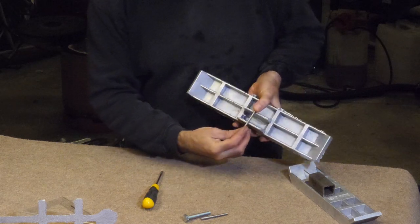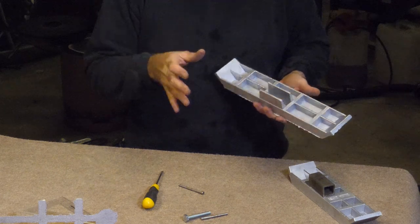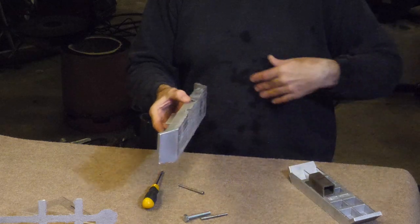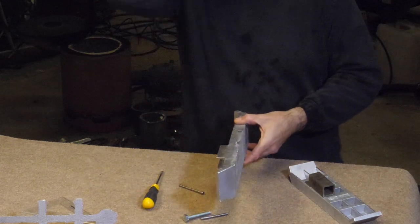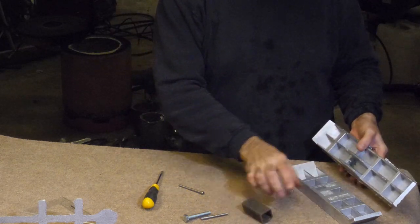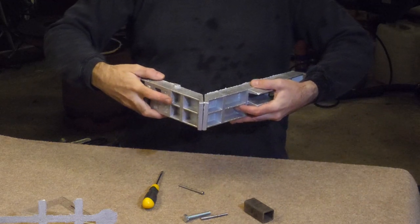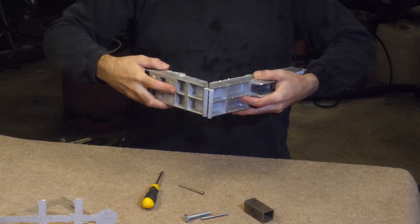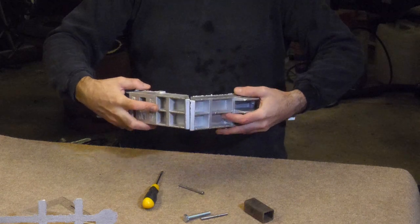A pin going through that would also work, I suppose, with an accurate drill press. I guess the point is to make it up into a square or a rectangle, and then when that is sitting square, drill the hole. Once I get this casting properly, the next challenge will be to try and fix these. I think drilling holes and bolts will do it. And then putting it on something flat and tightening them carefully until it stays flat.